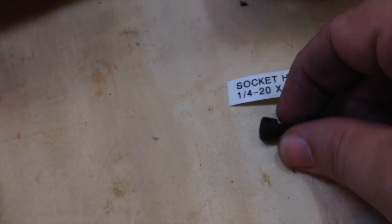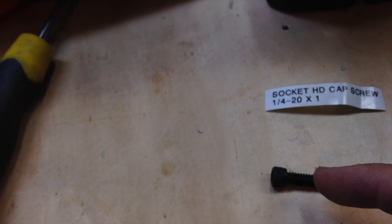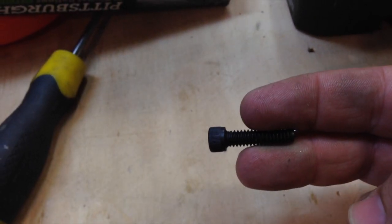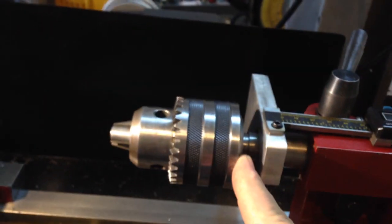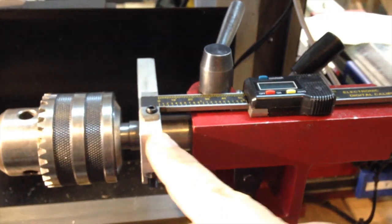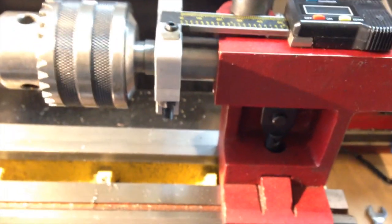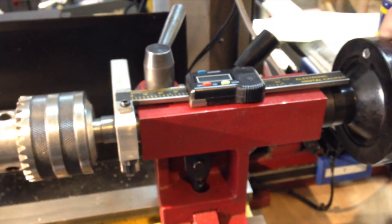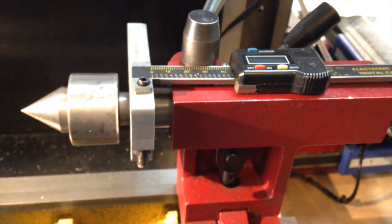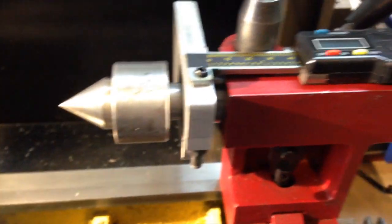The problem was getting rid of this — taking it off the quill. So what I decided to do was use a longer threaded solution, but it turned out the thread was not only metric but left-handed. Needless to say I'm not set up for that, so what I ended up doing was threading into the threaded rod and tapping it for a socket head cap screw. I threaded the rod and inserted this socket screw about this far, which effectively lengthened the rod by about that much. What that allowed me to do is release the chuck before the aluminum part hit the front edge of the tailstock.